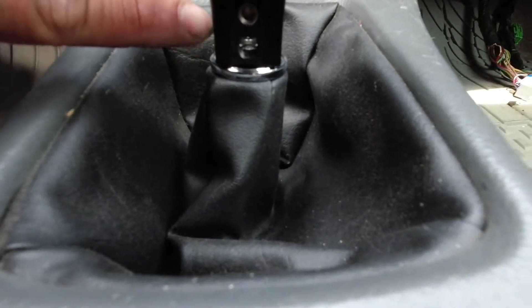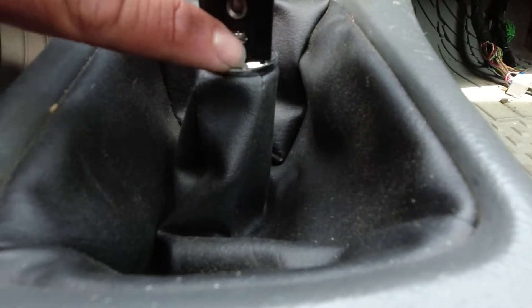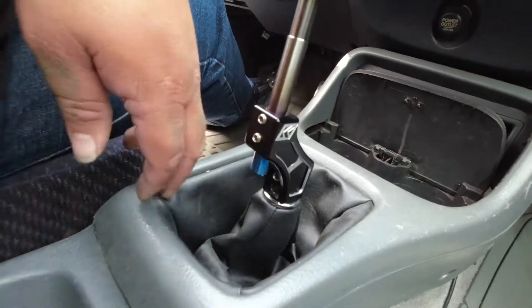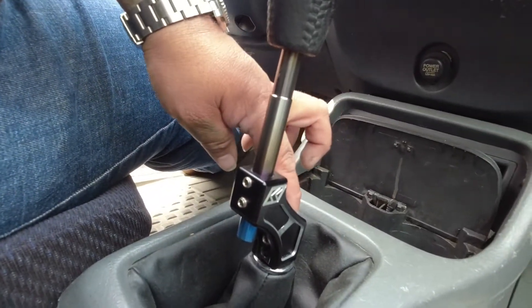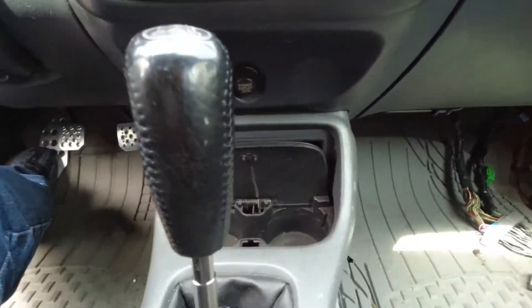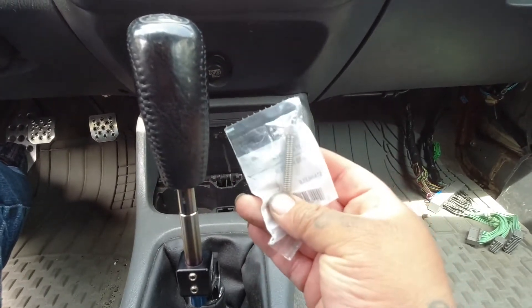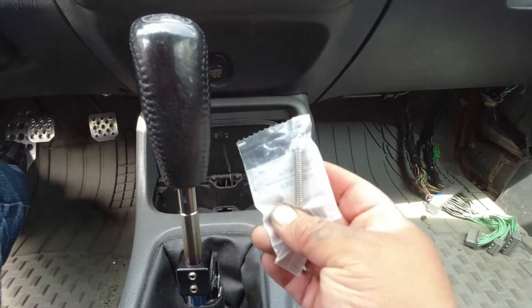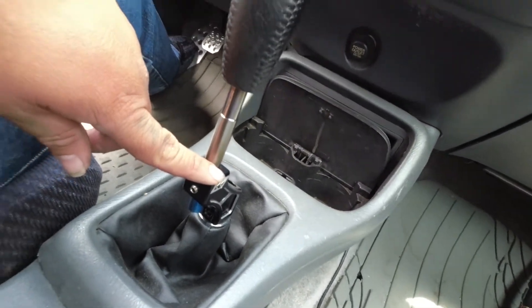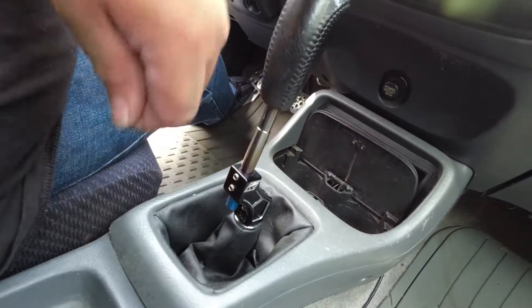Only that first set screw fits, and then since the distance is so high, the screw that goes in here doesn't fit because it's too short. But I fixed that — I went to Home Depot and got a longer screw, so hopefully it's not too long. This could also easily be avoided by putting some Loctite on the set screw so it would never move.